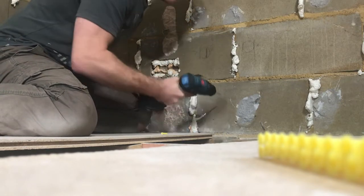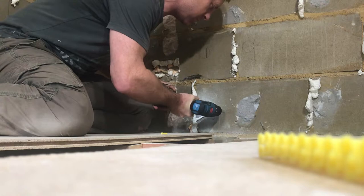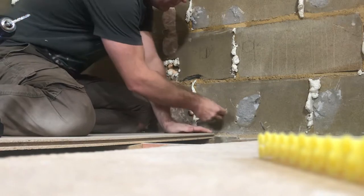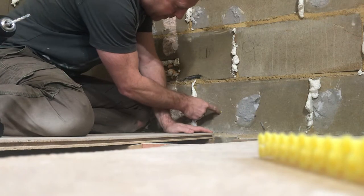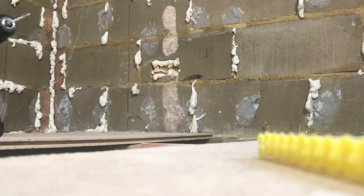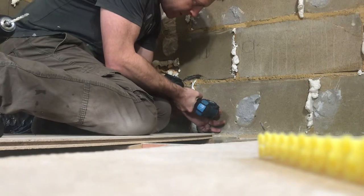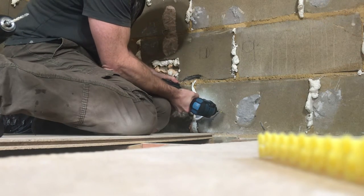Full length drill going in there — put it on camera function, full torque. Right, I've drilled that full length, but this rawl plug will sit on the edge and can't go any further because it flares out — that's what they're designed to do. Get the impact driver just to prove it — I'm going to ruin my wall here. Plug the screw in. See — rawl plug flared, it's not going any deeper. Happy days.